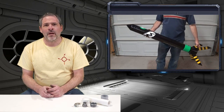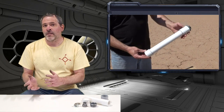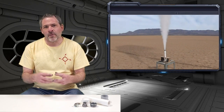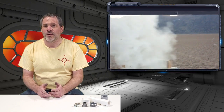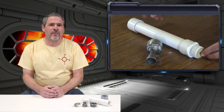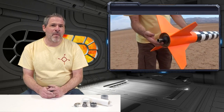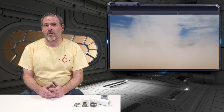But we wanted to go a little bit bigger with our rockets, and when we got into the 4-inch diameter rockets, like our Eliminator series, we needed something a little bit more powerful. So we started experimenting with expanding that motor size up, but we had a lot of problems — casing explosions, nozzles ejecting, gas blowing around the nozzle. Eventually, we just really gave up on the PVC design and switched to what we use now: our Robo-Monkey motor, which is an all-metal casing, a combination of aluminum and steel. We've launched it many times and it's proven itself to be a really effective and dependable motor for our 4-inch rockets.